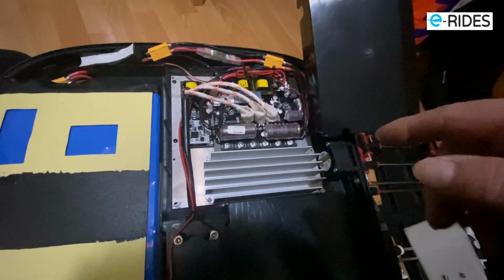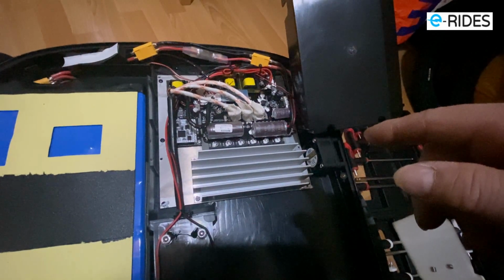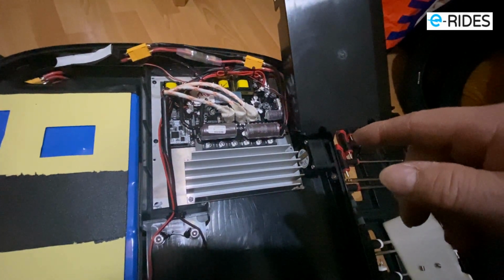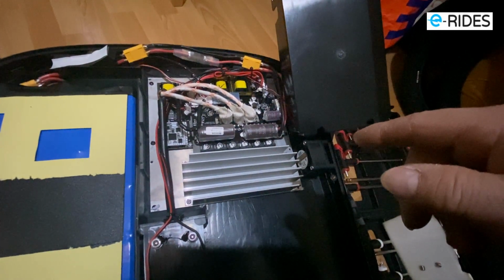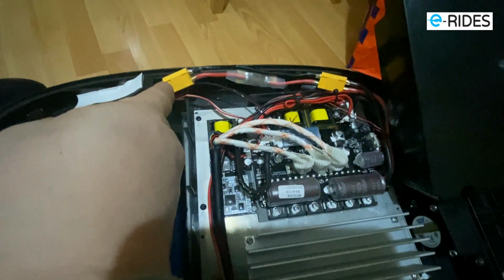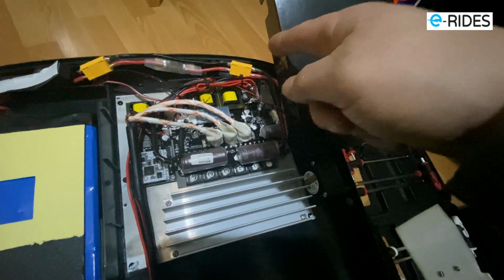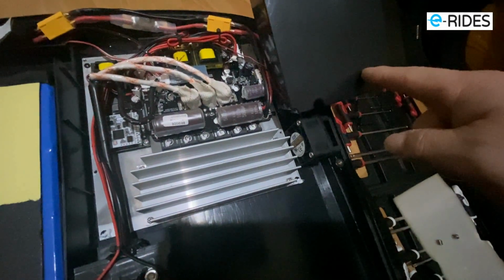Okay, if you have a Bluetooth problem with the EXN and the music, when you play music and it starts to cut out, what you need to do is check your EXN by opening the cover. But make sure you disconnect the power first before you do it. So disconnect the power, press the power button to discharge the wheel, then undo the cover.